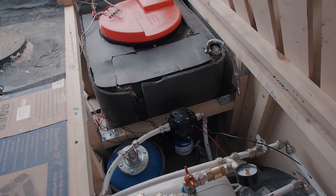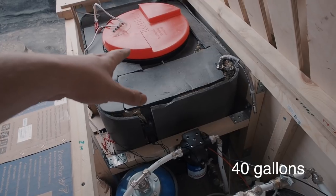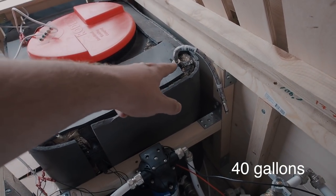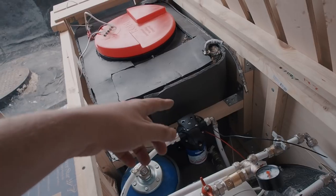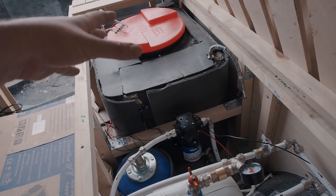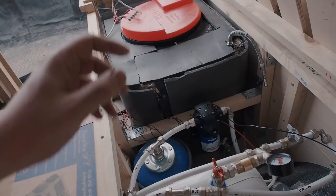And here is what I did with my water system. It all starts from the water tank. It's a 150 liter water tank, and here you can see I made an air inlet that allows air to go into the tank, because when you take water from the tank with the pump, you make a low pressure zone and it needs some new air to refill the tank.